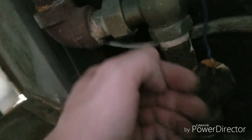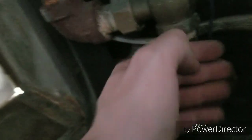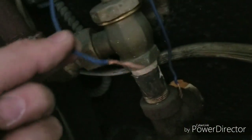Alright, got the third unit out here. We're in place. Here's a steam coil. Now, this is what you've got to look out for — see, this is disconnected. I think I've got heat coming up here soon, so you've got to be careful. You've got to make sure that these are connected when you winterize so that people can have heat.